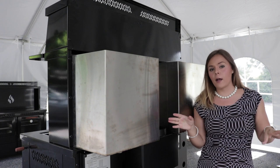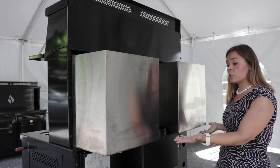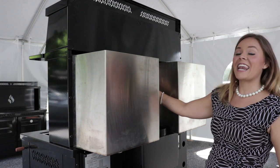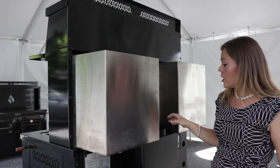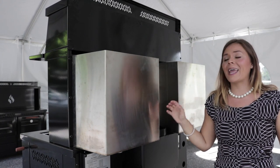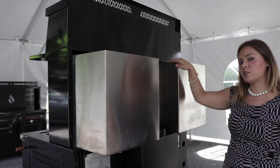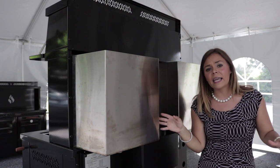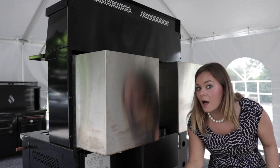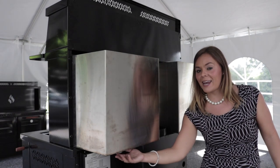This is going to be a standalone water tank that mounts to the rear of the stove. It does look like these are two separate tanks but they are actually connected through the center of the tank right where your chimney flue would go straight up. This system does not plumb into anything. You fill these water tanks through the top. There are lids that go over the top so you don't get dust or anything inside your water. You can add a spigot to the bottom of either side of the tank, depending on what's convenient for you.